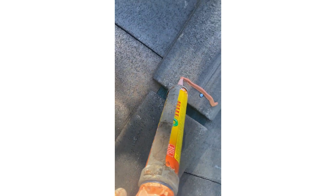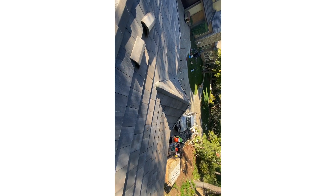On the main ridge, when the ridge is longer than 10 feet, I usually use a layer of self-adhering underlayment on top of the ridge board, then nail the tiles in place — by hand or by gun — and then put some silicone on the nail. I do it like this.